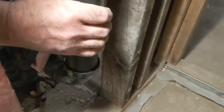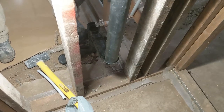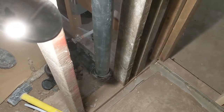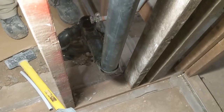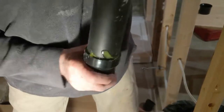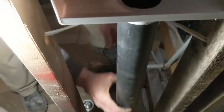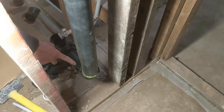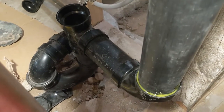This one here is gonna go like that — nice. This is nice and simple. Now all I have to do is glue it on. I'm just gonna glue these two pieces — this one and this one. The other ones I'm gonna leave loose. This is just for my reference for the future, because once we install the cabinet I don't want big holes in the cabinet — just gonna be one hole going to the floor, another hole on the side of the cabinet. Make sure it is nice and tight in there, then I'm just gonna come in here, put it in, push it up. You can see the pipe is right there, tight to the box — the sewer pipe is just about it, nice and simple. Once this dries I'm just gonna remove this part, remove from here and remove from here, and then we just put it back once we have the cabinet on.